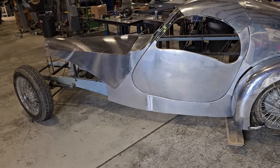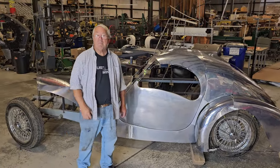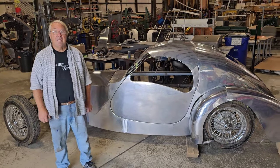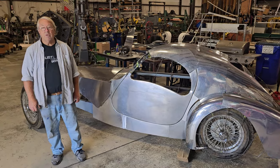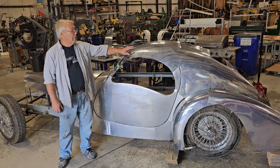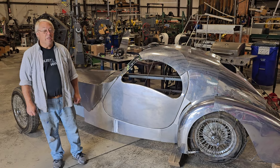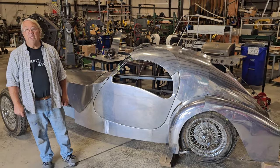This is his last day — we're about to load the car up; he spent 17 days. I just want to say thanks for coming. What a great project. The question I ask is: what was the most difficult part of this challenge of building these panels? Scott: Some of the panels look pretty simple, but when you get right down to it — like on top of the door — they're curved in several directions. While they look simple on the wire frame, by the time you've rolled them all out, they're actually pretty complex. And we're not using a stretcher or shrinker on the edges — it's all being rolled on the English wheel. I've learned a lot; it's been a challenge, but I'll be able to do this a lot more quickly on the second side.